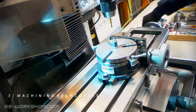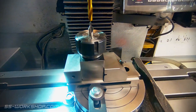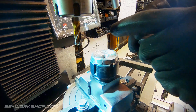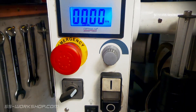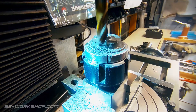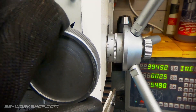The next step is to head over to the mill where I'll cut the remaining features on the cover. For this I'll be using the rotary table. I'll be cutting an offset curve so I have my toolmaker's vice set up on the rotary table offset by the radius required. I then have a collet block located in that which will allow the part to be flipped 180 degrees. A fixture located in the collet allows the part to be held securely. I make small cuts of about half a millimetre at a time.